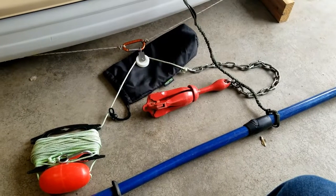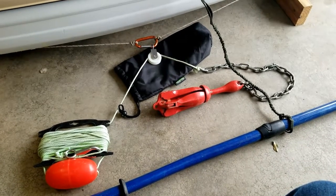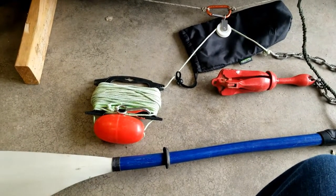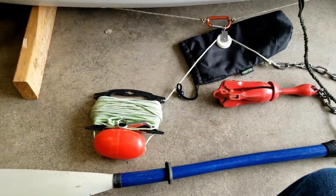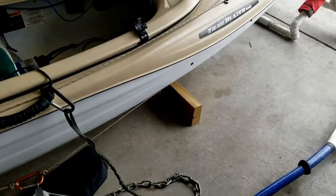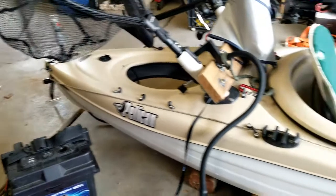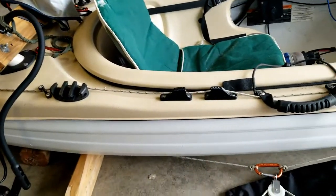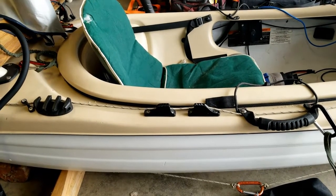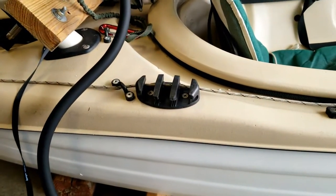You'll see some miscellaneous anchor stuff. The anchor has a little storage bag terminated with a chain through a roller and to a hand wind-up spool — I got that at Home Depot. The anchor trolley, front and rear, runs on pulleys with eyes from point to point, with anchor hold points for keeping the anchor trolley in position once it's set, and then also an anchor line cleat.